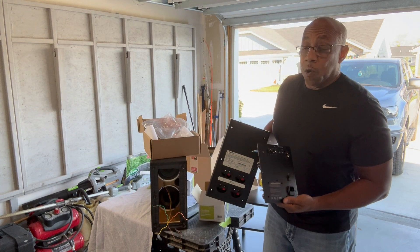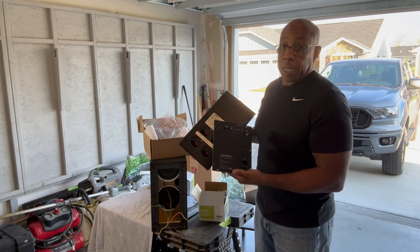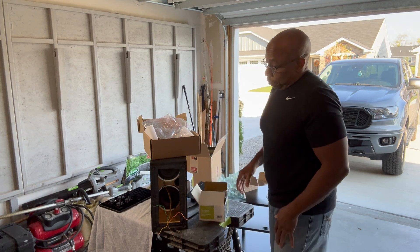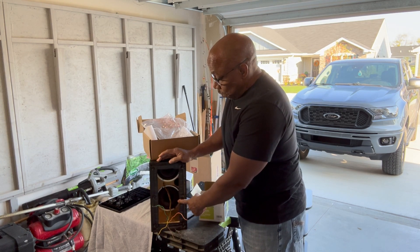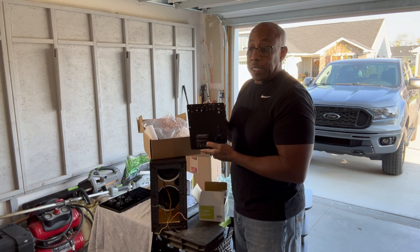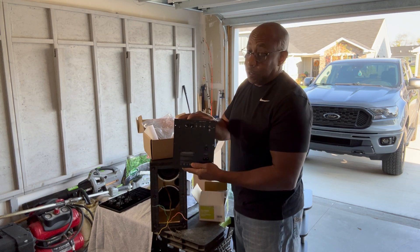The speakers I did get are four ohms. I'm going to wire them in series to bring the four ohms up to eight ohms, which this amp can handle fine. My next steps are: yank the two original speakers out, get the other two speakers in and wired up, and get this plate amp mounted on the back. If it doesn't mount on the back, I'll have to retrofit a board to the back and mount the plate amp to that board. But I'm hoping I can get it on the original back.